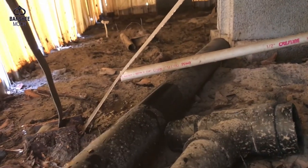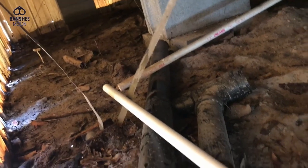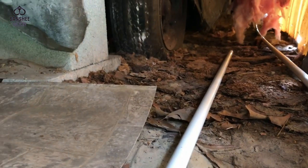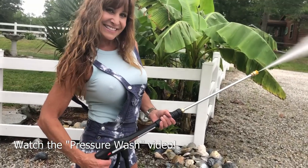All right, we're just about done there. Now I'll find when I lift this up on this side, it'll stop leaking because it's going to belly out over there, and that will contain the water. So I can dry and quickly cement these together. Get everything ready now. You see the three parts of the T here. I have forgotten my tape measure. I forgot to grab it out of my truck, which is down the road. No biggie, but this is good because this will show you how easily this can be done. So what I've done is laid this piece that I'm going to cut.